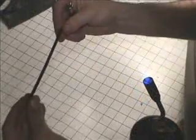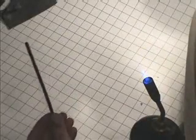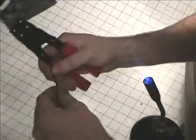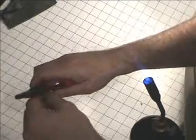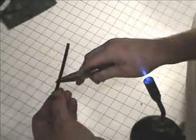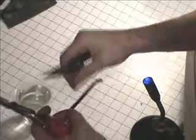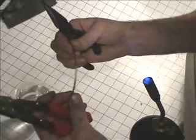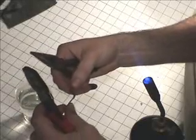Using this 6-inch junior hacksaw blade, it's still very easy to make a suitable tension wrench. But first we've got to get rid of the little ends. It's pretty simple. Snip them off with a wire snip. And this process is very similar to what we just did. We want to heat the blade up and create our 90-degree bend. With these longer ones, I like to make a double wrench. The longer shaft gives you a good flex, whereas the part that's fire hardened has very little flex and is very rigid.